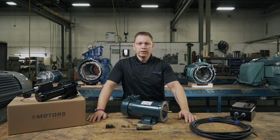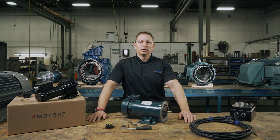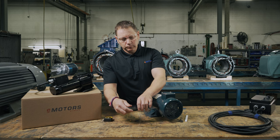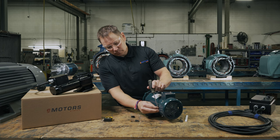Now we're ready to check the carbon brushes on my 90-volt DC motor. This motor is already removed from its power source and the equipment it powers. In many cases, you can check your DC motor's brushes while the motor is still in place, but removing it from the equipment gives you more room to work and see any possible issues. Step one: ensure your motor is disconnected from any power source. Step two: remove the carbon brush covers. You may even need to remove the enclosure to find the brushes. Check your motor's manual for help finding their location.